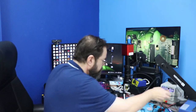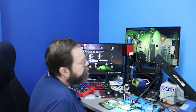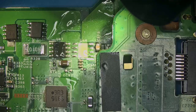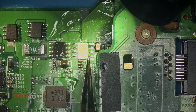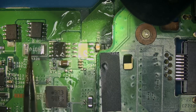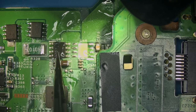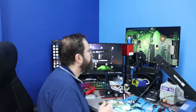Let's take our power, turn it on — it's 19.5 volts, zero amps. So you think, okay, problem solved. But you need that first MOSFET. Looking here on the microscope, you need your power to go from source to drain, to the drain on the second MOSFET, into the inrush resistor and into this circuit rail — that's where the circuit starts. Your DC jack also bypasses these two MOSFETs and goes to your BQ chip, and we'll talk about that later. But we can't just call this fixed.